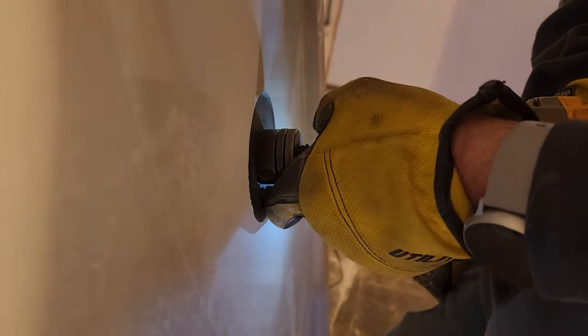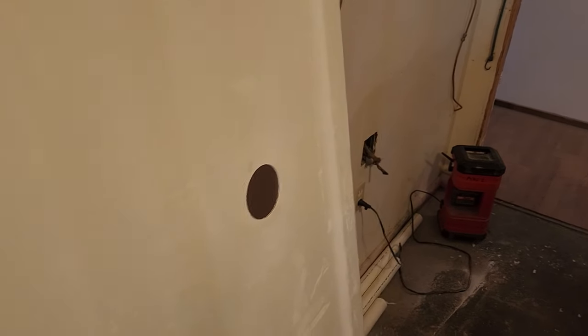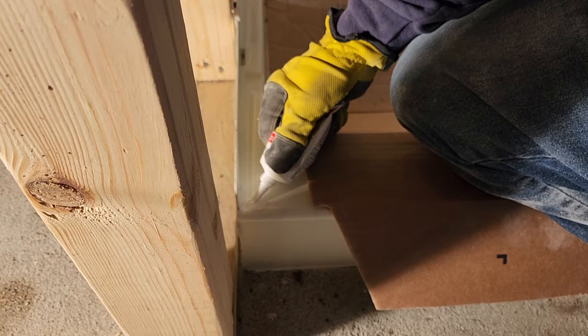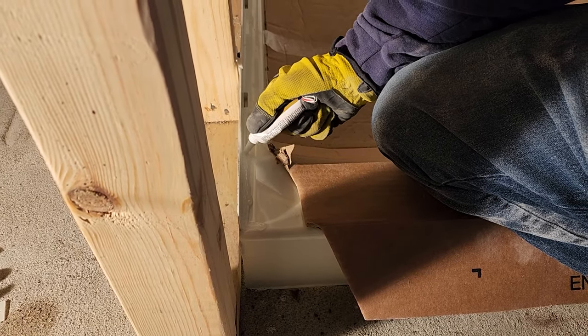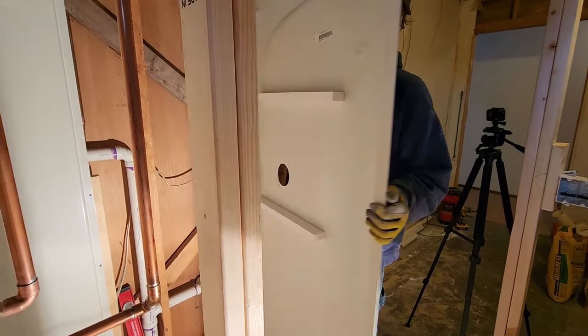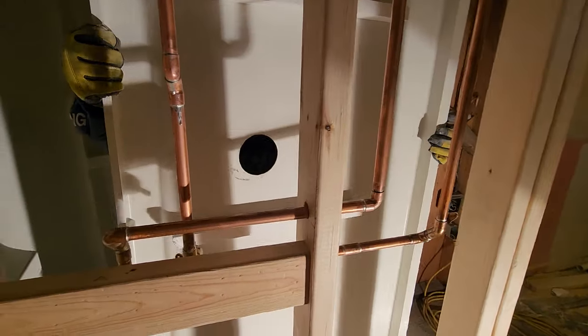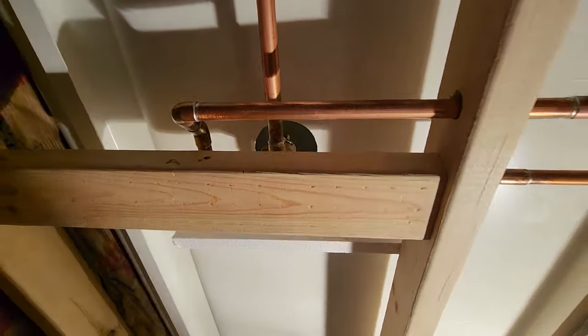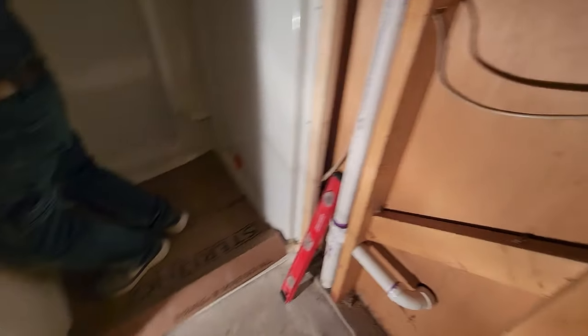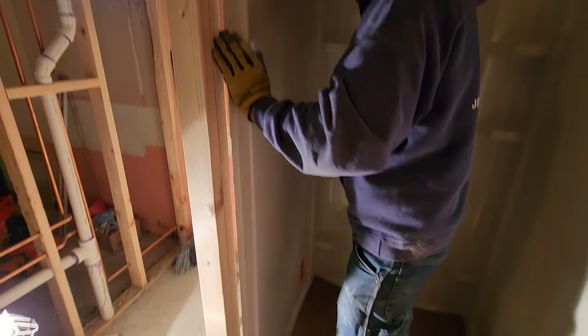There you go — nice and easy. If he did everything right, that's the moment of truth. On this wall, he's putting the silicone bead — remember that orange sticker — a little bead of silicone on top of the shower base right there. Now he's going to bring this wall over. There are pegs on the back of the wall that slide into the hooks of the back wall. This wall is a little more difficult because you've got the shower valve in the way. At the end of the day, you want your shower valve centered in the hole — and remember, you've got a chrome trim plate that will cover that hole.